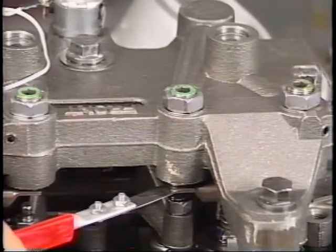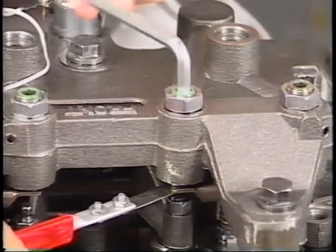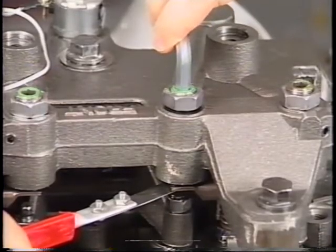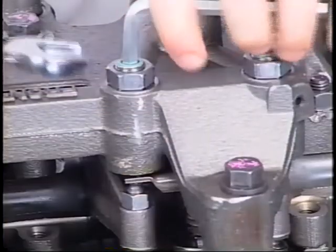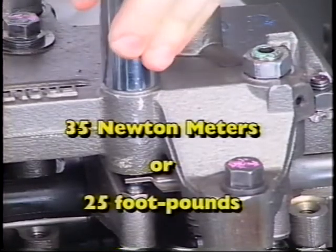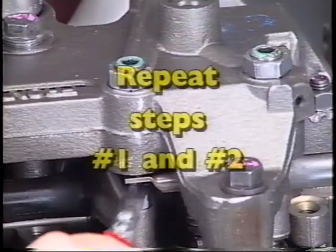If the oil is below room temperature — 16 degrees Celsius or 60 degrees Fahrenheit — wait at least two minutes for the oil to be purged from the j-lash adjusting screw. Number three: after waiting the required interval to purge oil from the j-lash adjusting screw, back out the adjusting screw counter-clockwise until the feeler gauge can be moved with a slight resistance. Do not back out the j-lash adjusting screw more than required to obtain a light drag on the feeler gauge. Torque the lock nut to 35 newton meters or 25 foot pounds. Number four: after torquing the adjusting screw lock nut, recheck the lash setting. If the lash is incorrect, repeat steps one and two.